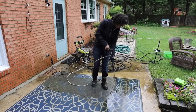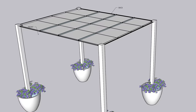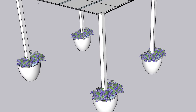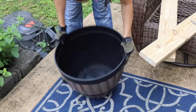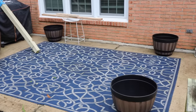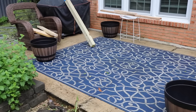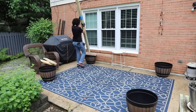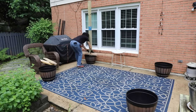Once that was done it was time to move on to the planters. The idea I had in mind looked kind of like a pergola — four by four posts sitting in concrete and plastic planters with flowers, and then I was going to make a canopy for the top. I decided to use plastic planters because I didn't want anything that would rot over time. I got the planters, set them in the general location, then using scrap wood I set it on top of the planter, put the four by four post in, and attached it with some screws.